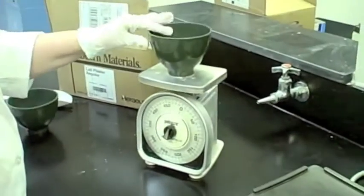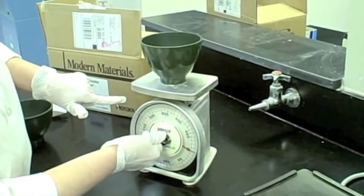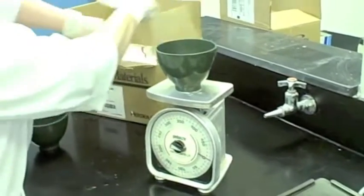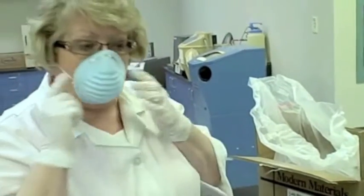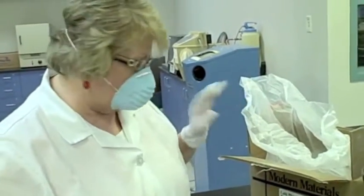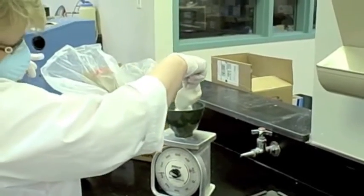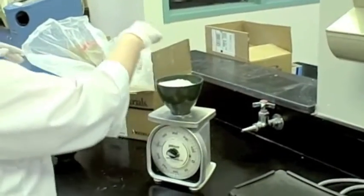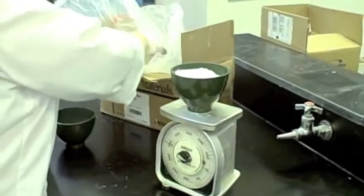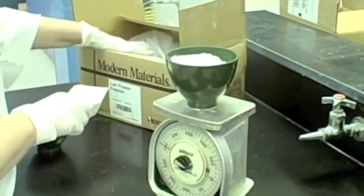The plaster is going to go into a smaller bowl. Set your bowl on the scale, then take the zero and adjust it so that it is in line with the red indicator. Measure out 250 grams of powder. When you're doing this, be sure to put your mask on — ideally a dust mask for gypsum. Fill up your bowl until you get to 250 grams; if you have over, just take some out. Make sure that you close up the plaster bag so that moisture won't get in.